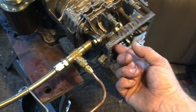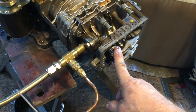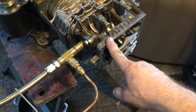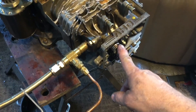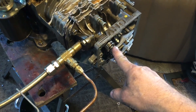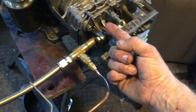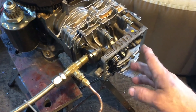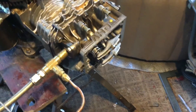With a regular internal combustion engine, you have suction coming in on this side, so there's very little need for a big spring — basically just to return the valve, since there's not much pressure pushing it from the inside. But with steam, you have pressure that can float the valve — the valve gets pushed down by steam pressure — and then your engine won't do much except blow steam past the piston rings, which is another issue with steam engines in general.